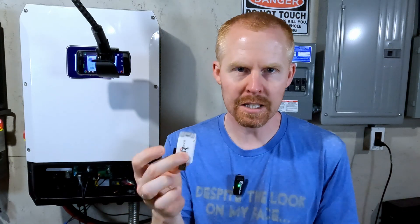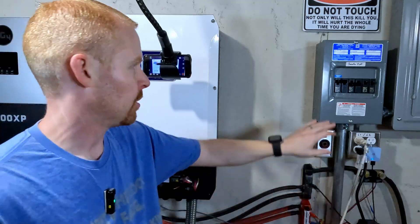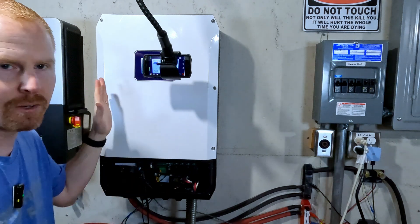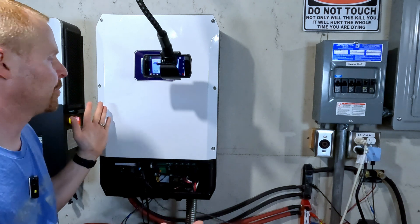Before you plug the thumb drive into the inverter, you should do a couple of things. Turn off your PV disconnect, turn off the RSD switch, and turn off your AC output and grid input. That way your inverter is solely running on battery power — you won't have any accidental unknown power losses during the firmware update. Your inverter should be fine and shouldn't restart during the display firmware update, but when you do the actual inverter firmware later, it will restart. So get it all prepped ready to go now. I'll turn off my AC output, turn off the PV switch, and press the RSD button. Power might go out on the display for a second and then come back, and then it's in battery mode only.